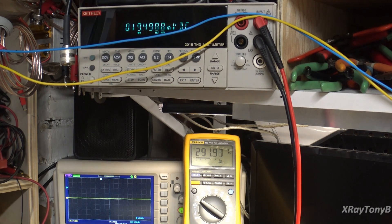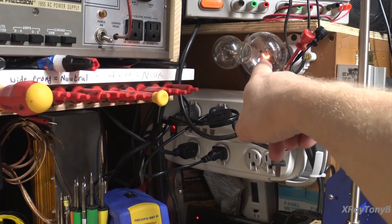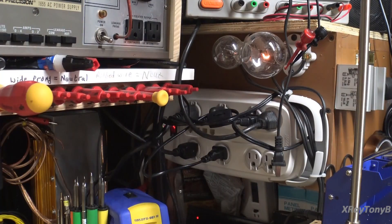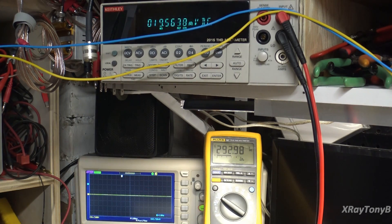Close enough. I've got my dim bulb — it's not burning very bright but it is lit. I am now going to flip to full power. I'm clear down to 300 volts through that dim bulb, and the voltage will keep dropping as I increase the current. Oh, of course the phone is ringing.